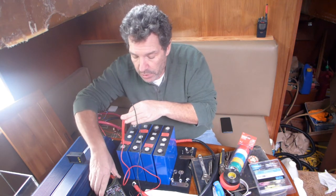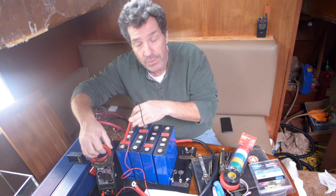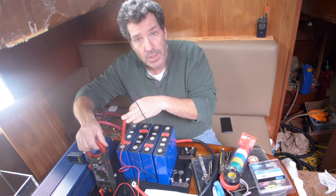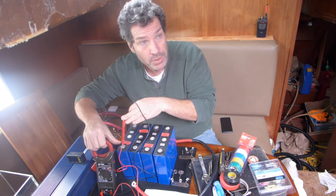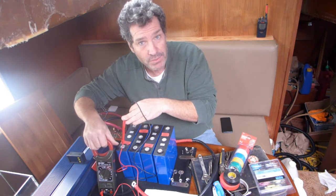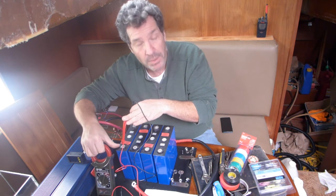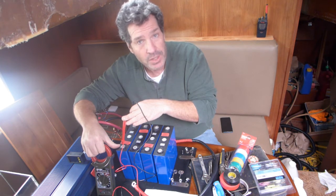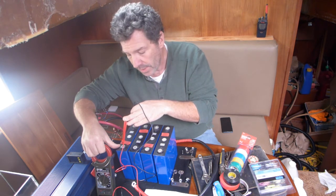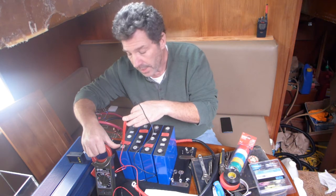This is a 3.2-volt cell, but I fully charged it. I discharged them completely — down to about 11 volts — and charged them back up several times, as I recommend doing with any cells you buy. A lot of times the cells sit in storage for months, if not maybe years sometimes, and they kind of need to be restarted as far as the chemistry involved in the cell. I recommend discharging them. I've seen videos where people have to charge and discharge them six or seven times to get the full capacity when they're brand new. I've done these about four times — completely discharged and completely charged back up — and equalized them all.